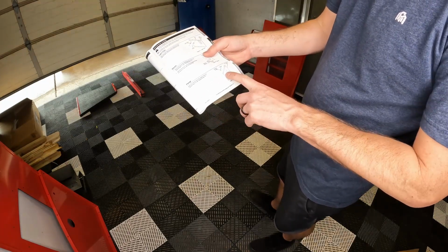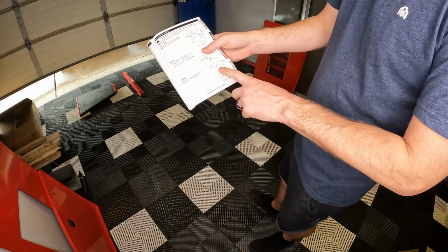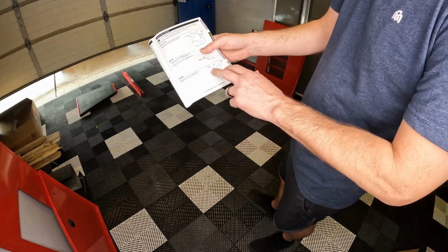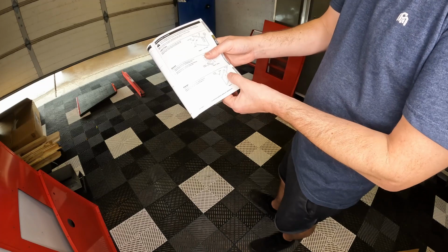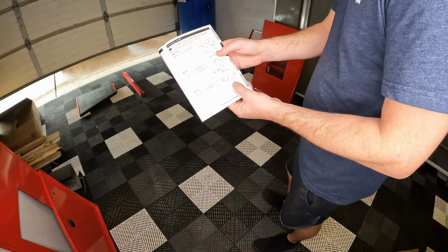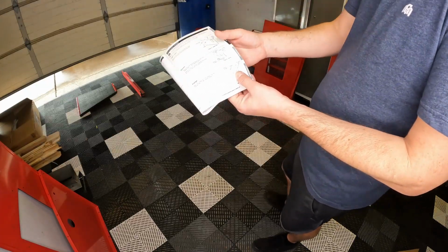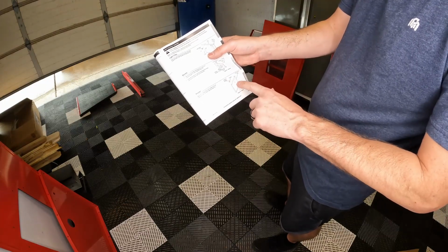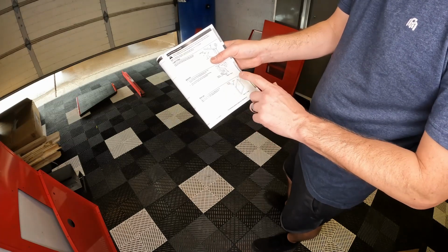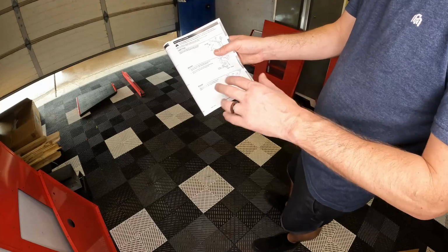I'm also a little bit wary of this as well, because I believe that this flange on the left-hand side is for a vacuum port. And using tapping screws, there's no gasket to go behind it at all. This is just a plastic flange attached there. So instead of doing that with the tapping screws, for one, since I do not have them, I do have an SAE set of nuts, bolts, and washers. So I'm gonna go ahead and attach that with nuts and bolts. And I may be changing the location of where I want the vacuum later, so this flange port may get covered up completely. So I'm gonna go ahead and switch those out, then we'll continue on.